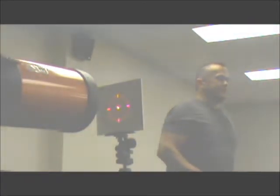The inner tips of the laser crosshairs are cropped by the secondary mirror assembly and are shifted to the left. This means that the secondary mirror is not positioned properly. It is absolutely essential that the secondary mirror is positioned centric, in the center. It's not. We have to go up a little bit. See how it's cropped? It's more down to the 3 area. Oh, okay, I see what you're saying. It's not centered? Okay, that's when you loosen again. Hopefully the scope won't move. Let's back up a little bit.